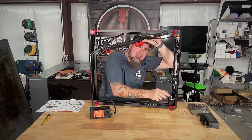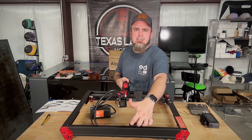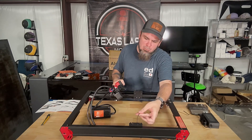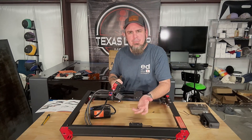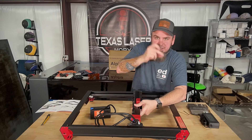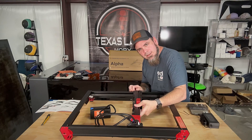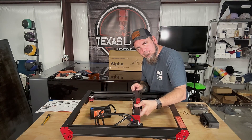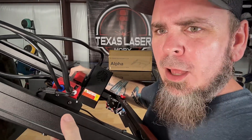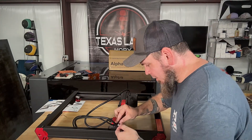We now have our motor over here to plug in — it's on a wire, snaps right in, making it a breeze. Next, we're going to screw this to the rail — it'll take two screws on both sides. You do got to be careful because there are some wires over here as well as up here; make sure not to pinch them. This will slide right into place and you'll take the same allen screws and screw them in. We also have this one little wire to plug in up here.